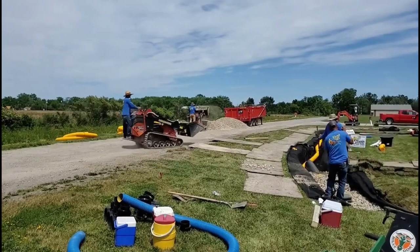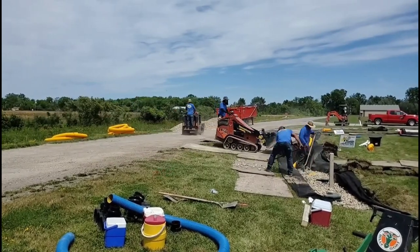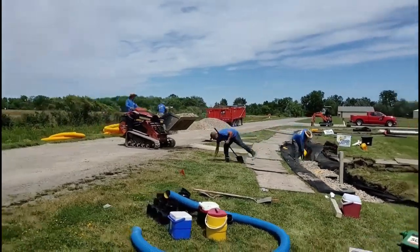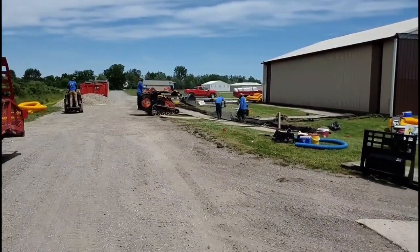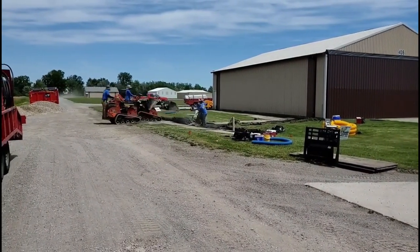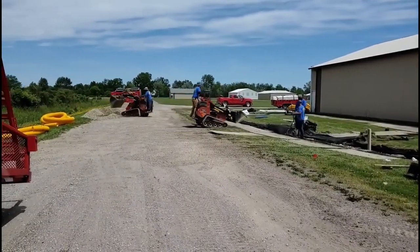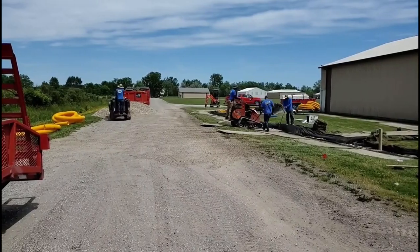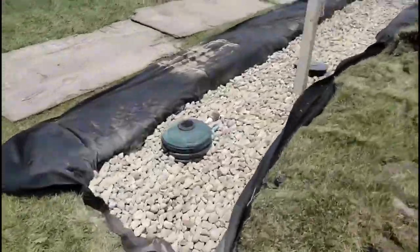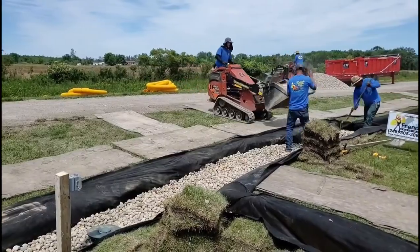If you follow this channel you know we have dozens of variations. This is the one we use most predominantly outdoors. Indoors I'm always going to use the Screaming Demon — it was built for a couple of different specialty uses. If you're going to put a check valve on your outdoor system and you live in the south, you can get away with the Screaming Demon because you're going to suck every last drop out of the chamber since the pump sits lower than the chamber. But here in Michigan we can't use check valves — in the north we have to build them with winter in mind. We have a heater in this system, and we don't have a check valve, so we pump the water up and have it sloped out.